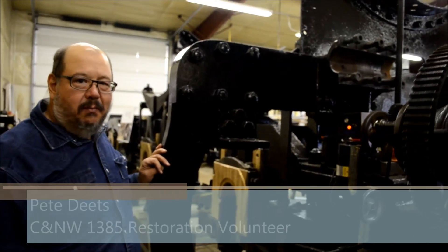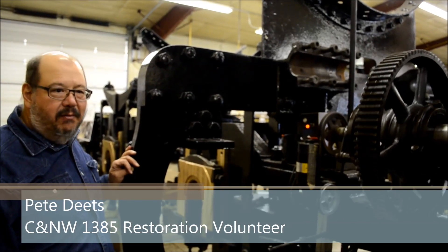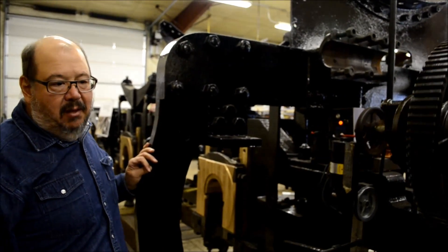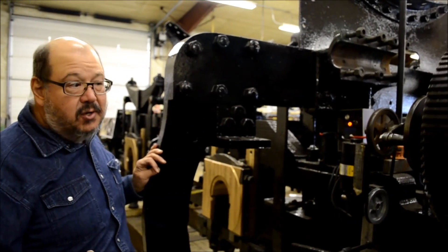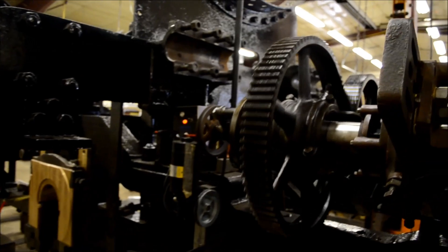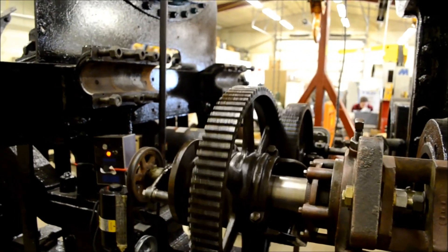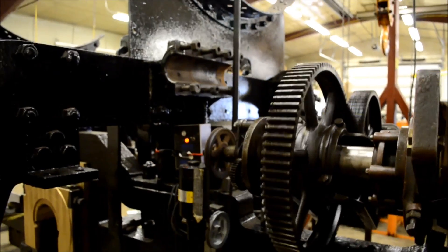This is the Underwood Portable Boring Machine. It was designed for smaller locomotive roundhouses, used for boring out cylinders and boring out valve cages. It was used at roundhouses that did not have full facilities to tear down engines to the component parts, but to make fairly heavy repairs. This machine is owned by the Big Comet Railway Museum, and as part of the living history of the museum, we're actually using an antique part to repair one of our antique engines. We're using a proper steam era machine for what it was intended for.